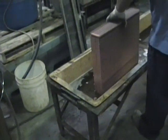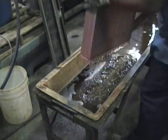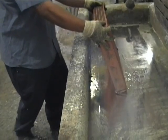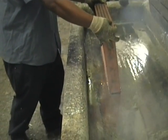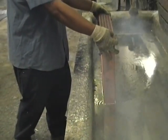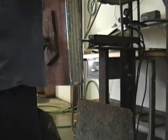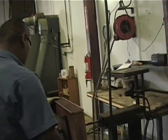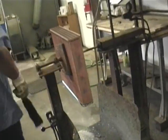After baking the core, the header plates are ready to be attached. First a dip in the flux pot. The header is then dipped into the solder tank. The technician holds the header under the solder until all the tubes have had a chance for the solder to flow around each tube. The header plate is sprayed off with air to remove any solder inside the tubes and the excess is brushed away. The other header plate is dipped repeating the process and the core is now ready for testing.